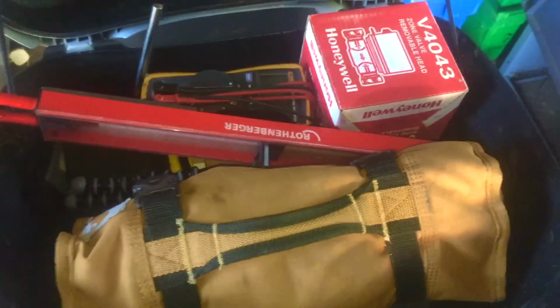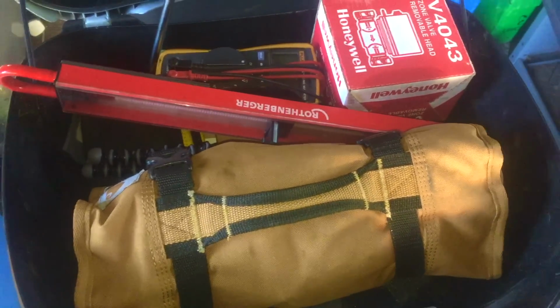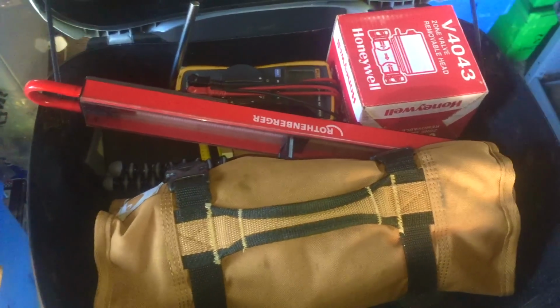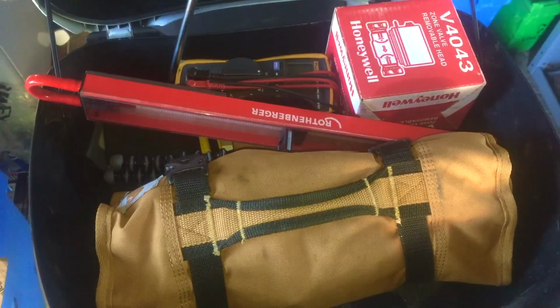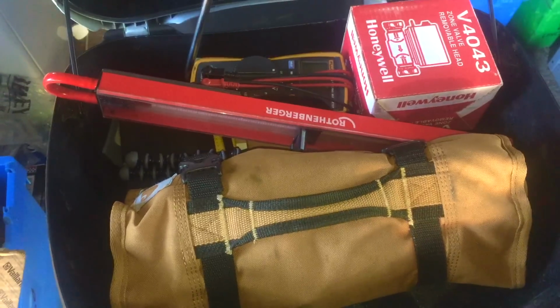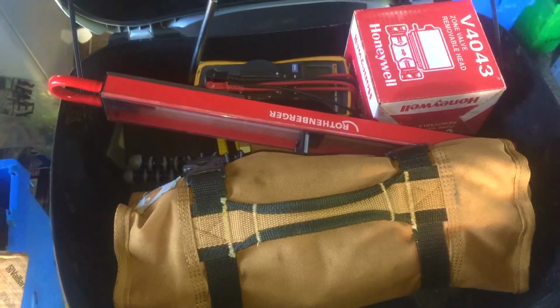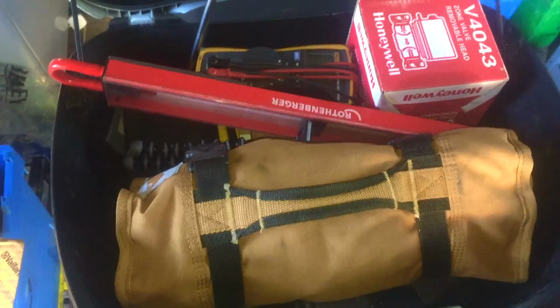And that'll just be for the actuator. If I had an actuator, I'd bring that by itself, but I don't. So my other thought process is this boiler has its own pump overrun in it, so it controls the pump itself. That means if that pump's running, the boiler's telling it to, if it's wired correctly. I didn't check that last time, but I will this time.